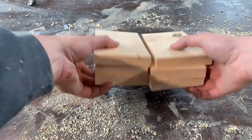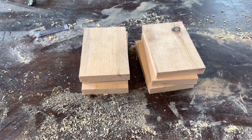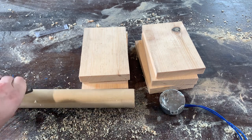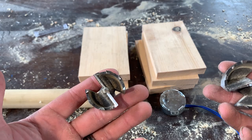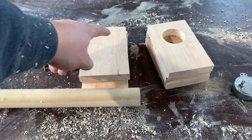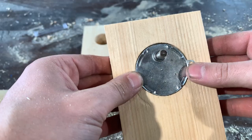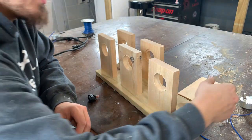So I got six pieces — three will be for the back and three will be for the pivot point. I have two different holes to cut: one for the motor and one for the rod. The rod itself is an inch and a half, so I have an inch-and-a-half spade bit. The motors are about two inches, so I'll use a two-inch bit. Now to mount the motors inside the hole and get these mounted to a base plate.